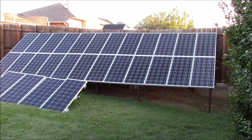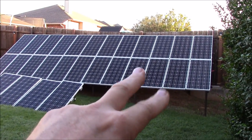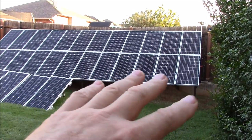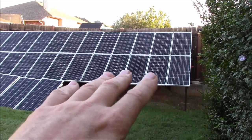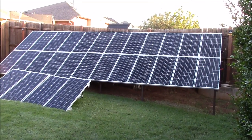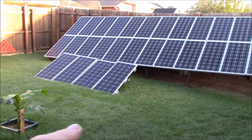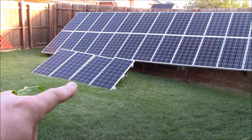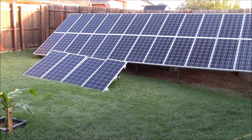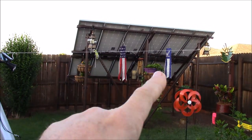It's been through two tornado seasons and performs great. Got two inline fuses at 30 amps because the overall power does not go above 25 amps through there, but the solar chargers can push 70-plus amps. The small array right down here is for my portable solar generator in the house — I'll show you that in a sec.